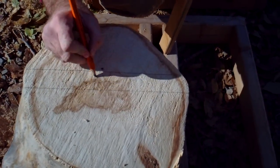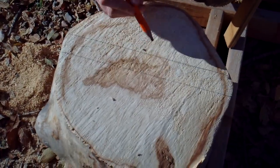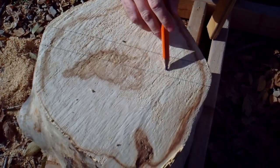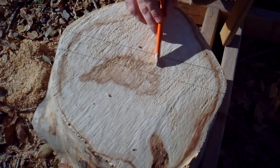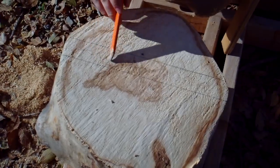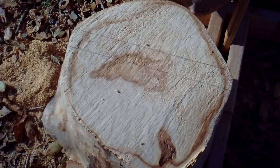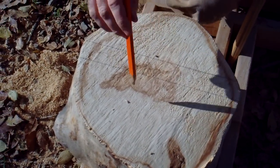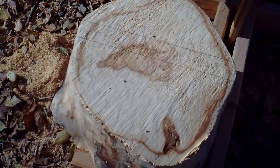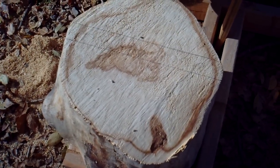I can take this area right here — I've got good quarter-sawn material that's going to be very strong and durable. I can cut the pith out on my bandsaw and then I have handle blanks, pen blanks, spindles, just any sort of really good wood. With a wood that's as highly figured as this is, you don't want to waste any of it. I'm hoping to get at least two big bowl blanks out of here and maybe 20 pen blanks or four large spindle blanks.